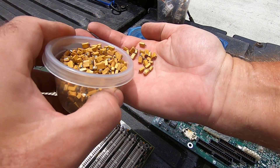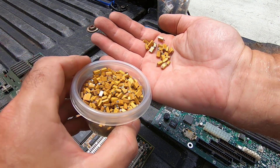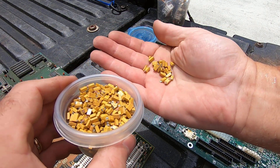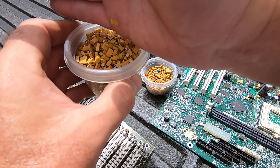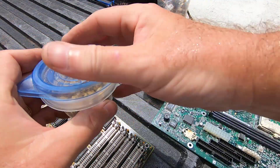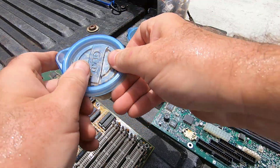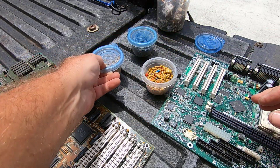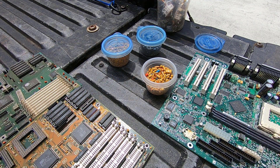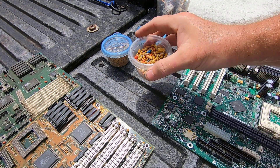And here you see various sizes of the mustard colored ones. Nothing in my research has told me so far that the niobiums come in the yellow color. What I've learned so far is that if it's yellow with the bar, it's tantalum. If anybody knows different on these and you can give me some references, please leave some comments with references so that I can make sure that this is as factual as possible.